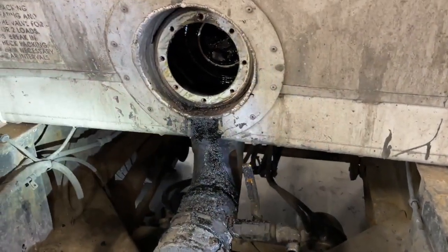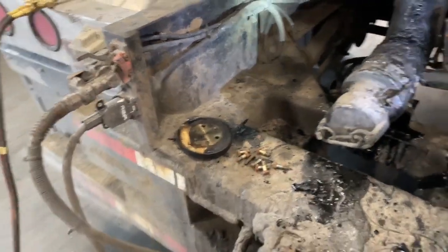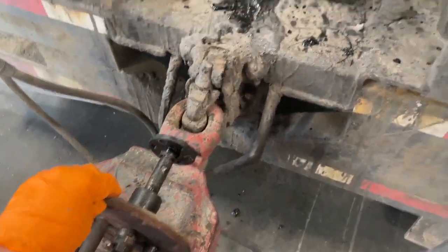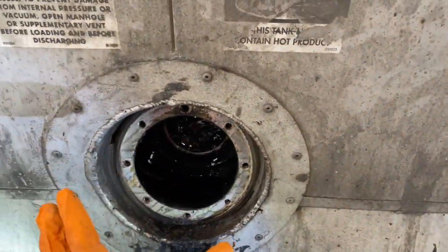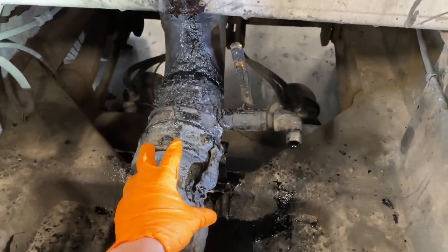In this particular one you can see how this started to chip away, so it was actually leaking oil even when the valve was closed — that's why we're fixing this right now. Another important thing to notice: this is actually what bolts here, but the valve is back here. Some people think the valve is right there on the edge — it's not. The inside edge of the trailer is way back in there.